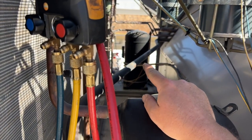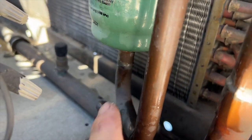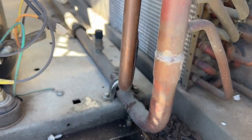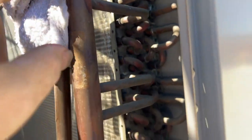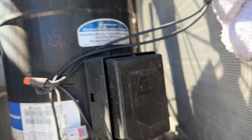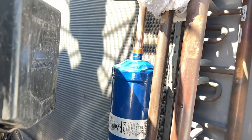I've cut the top and I'm going to sweat off the bottom, then we'll see what we've got to work with. Got it deburred and sent it down — cleaned it as best we could. We're going to go ahead and install it; our arrows should be pointing downwards because this is our liquid line. It comes out and goes to the coil, so we always want the arrow pointing towards the indoor coil. Got her in place — using the old line dryer to hold it up so it doesn't pop out while I'm brazing it.